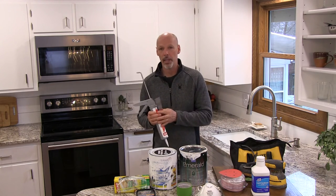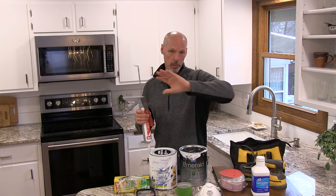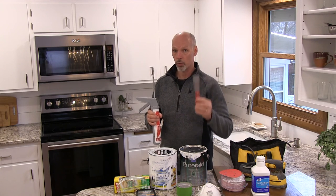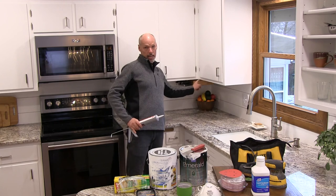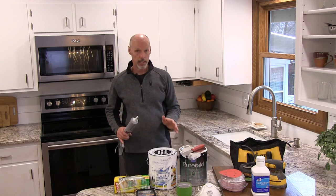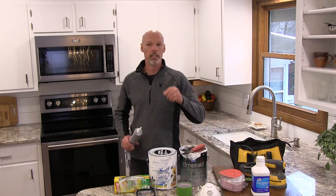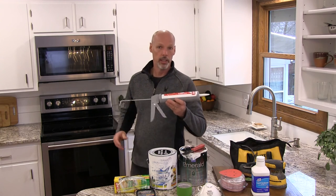For wide cracks, instead of just using a wet finger, use a small spatula to brush out the caulk so you get less coving. We have a little coving in some spots from trying to fill wide cracks with just a finger. There's also a corner where I forgot to fill with wood filler, and we caulked it after painting — you can't even tell it's there. The caulk is just unbelievable; I couldn't believe how well of a job it makes this project look.